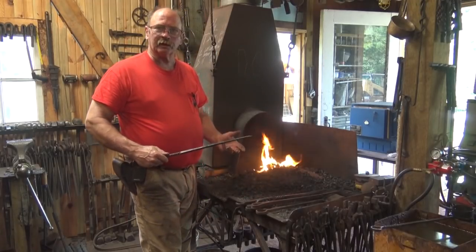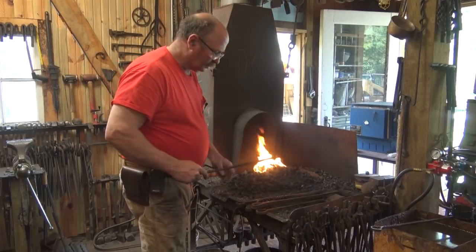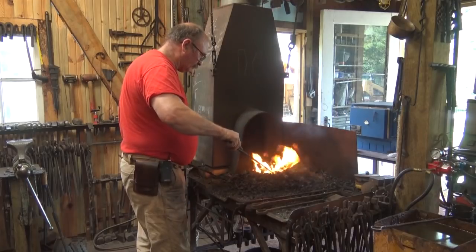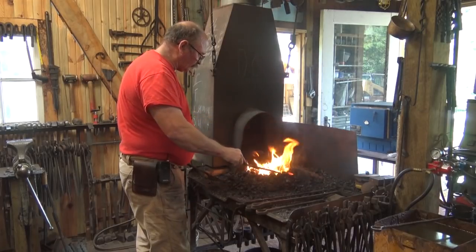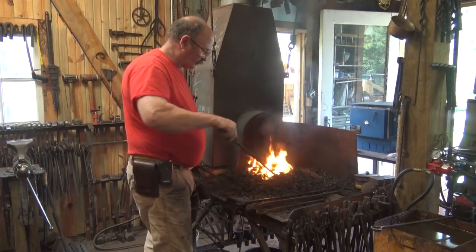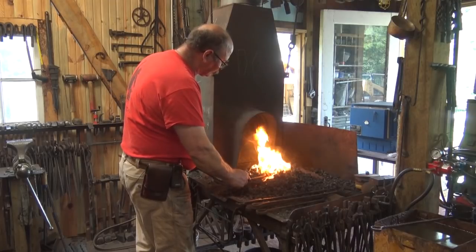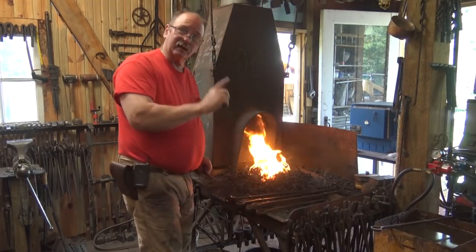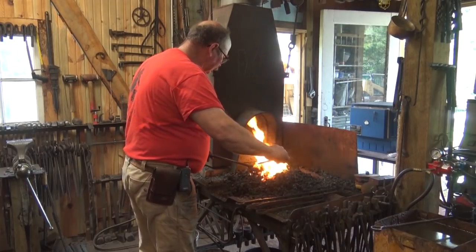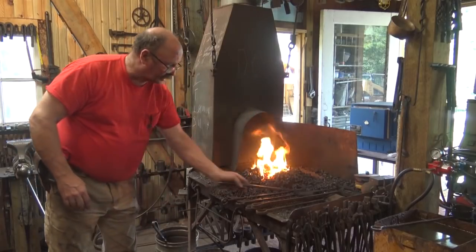One of the last tools that I use with a coal fire is just a straight poker, and I use that for getting clinkers out. After you've been working a while, the fire's all kind of torn apart — it's probably dirty and you probably have some clinker in the bottom. We've discussed fishing for clinkers in the past, and I'll try to link to that video. But you can use that straight poker to pull the clinkers out without disturbing the fire any more than you have to.